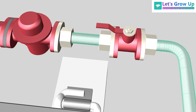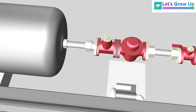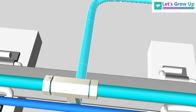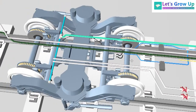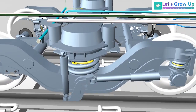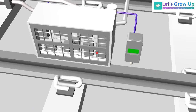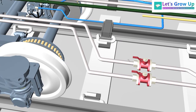Here is the branch pipe, and here you can see this cylinder. The cylinder has two or three components: an isolating cock, a dirt collector, and a non-return valve — meaning air can pass into this cylinder but cannot go back. The output pipe, in sky blue color, goes for both bogeys, right and left. This pipe connects with the air suspension, but this part is still under development. I have uploaded some spring-related suspension videos. Here you can see some parts — this is the FIBA unit, and this FIBA unit is for the air suspension system.